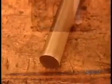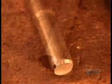Next, the machine forms the opposite end of the bolt. A tool called the pointer shapes the bottom of each bolt, creating what's called the chamfer — the part the nut catches onto. Here's the bolt before and after the chamfer.